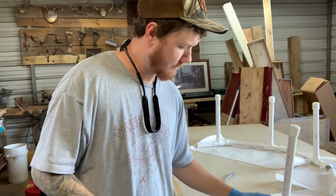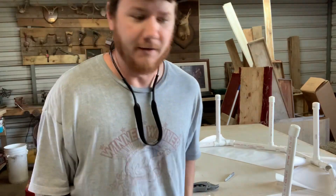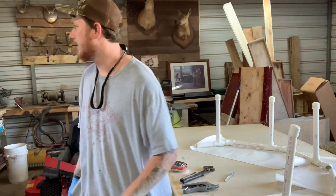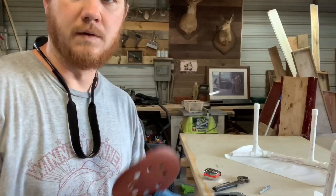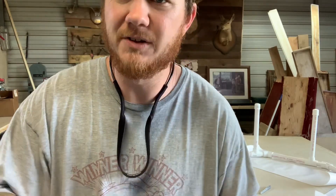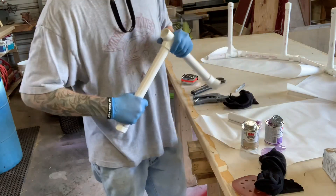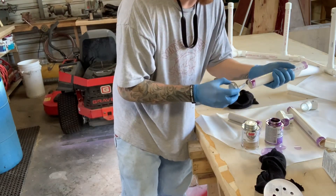I'll probably need some pliers to open up these cans. Got the primer open — get a piece of sandpaper, just 220 grit, nothing harsh. All you want to do is just sand it a little; this just roughs up the surface and makes sure it's clean. Then put just a little bit of primer on it — it makes a mess, that's going to look rough when you glue these. Make sure you glue your fittings as well.